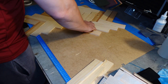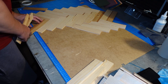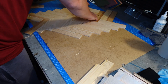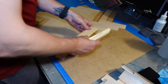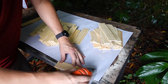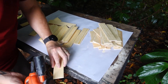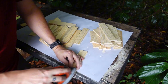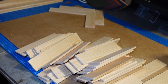So let's look at how we did this from start to end. I'm laying these pine strips out — I've cut them on a chop saw, all exactly the same size — and I'm laying them down to dry fit on top of a piece of hardwood, just to make sure everything fits as it should. Once happy, I take them out and sand all the edges. I just wanted a very slight round on the top edges of all the strips. It would have been easier with a router table, but I did all these strips by hand.